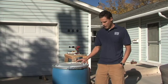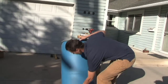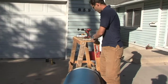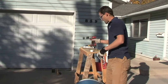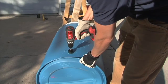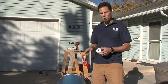The first step is to cut a hole at the bottom — this is where your drain will be, where you'll be able to drain the water out when you need to use it. Turn the barrel over, put on your safety glasses and your gloves, select a place down at the bottom where you want to drill the hole. Now that we've cut our hole, the next step is to insert the threaded bushing.